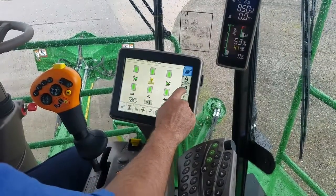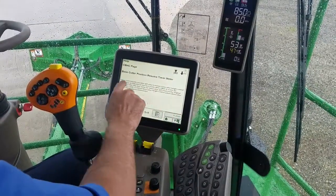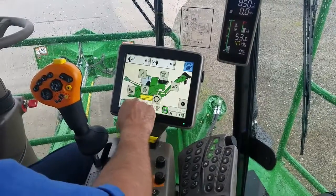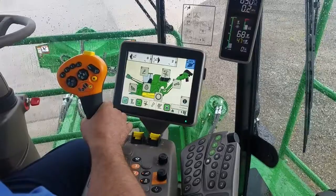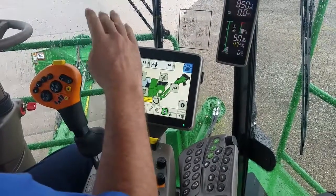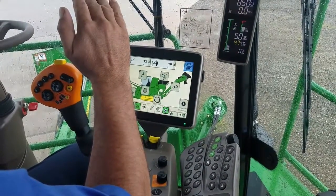The next thing on the Advanced Settings page is your position section — Base Cutter position resume timer. This adjusts how long the machine will stay in manual base cutter height control mode after a manual adjust is made. So if I'm in automatic mode and I make a manual raise, the machine goes up and then goes back down to your target. Basically, that's to go over a rock or something in the field. The machine goes up, stays up for a set amount of time, and then goes back into automatic mode. If you hit end of row, it will turn it off and go to the end of row setting. If you just press up on the base cutter, it goes up for a set amount of time and then goes back down.